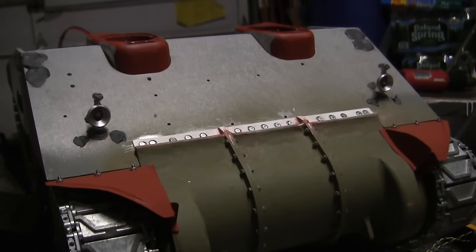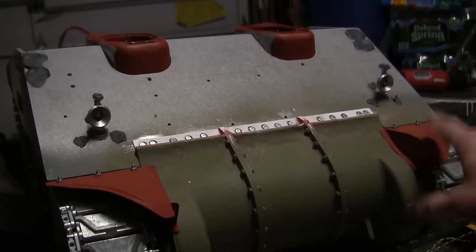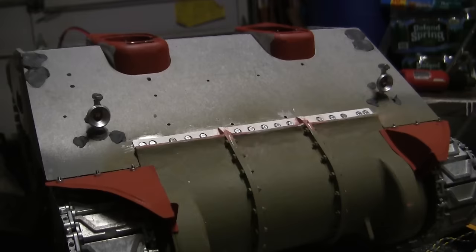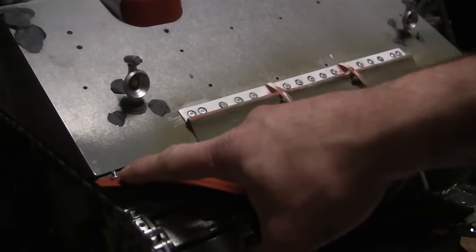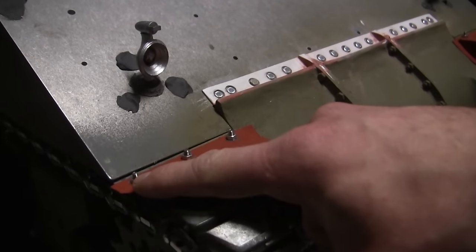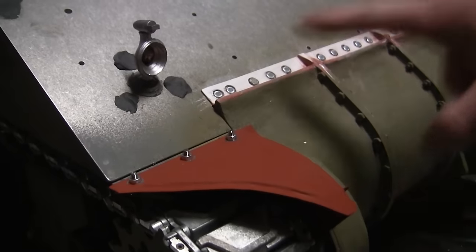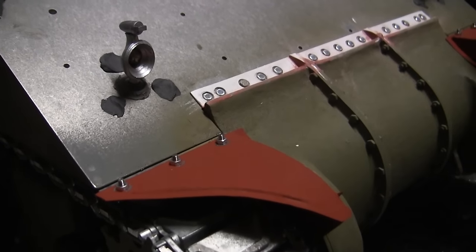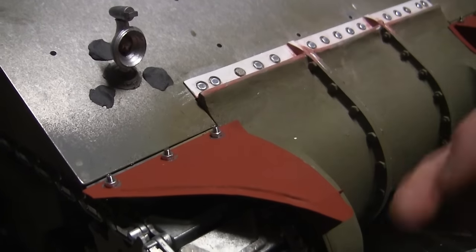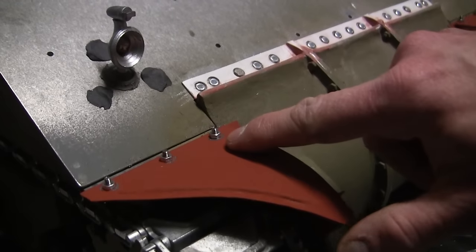In addition to the interior, a lot of progress is starting to be made to the front exterior portion of the build as well. As you can see, since the last scene, the front mud flaps that were mentioned earlier have been mounted to the tank. Now, as a quick note, the fasteners that you see here are mounted with the head of the fastener on the bottom and the fastener nut on top. This is a mirror image on the opposite side. The way you see it here is accurate for that of Sherman tanks. All Sherman tanks feature their front mud flaps mounted to the tank in this manner.